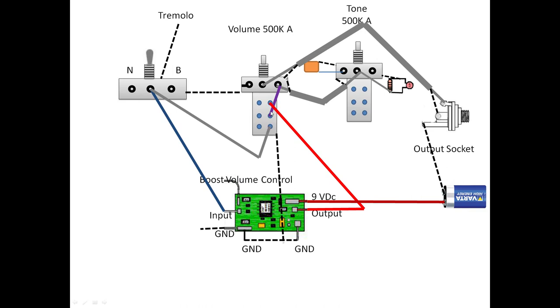If there's no battery when you press the push-push, it acts as a kill switch. If there's no battery and the push-push is down, the guitar works fine because we have a direct connection bypassing the boost circuit. For the second upgrade — controlled boost amount — you can add a 220k variable resistor (or 200k as I did). There is still one problem: with the guitar cable plugged in, the battery is continuously used. The best solution is to remove the ground and connect it to the middle point of the push-push, so the circuit is only electrically activated when you press the push-push.